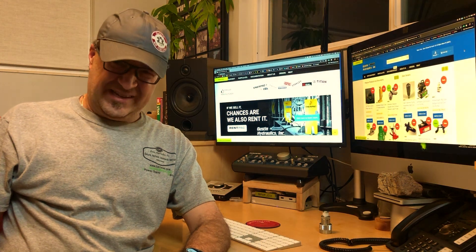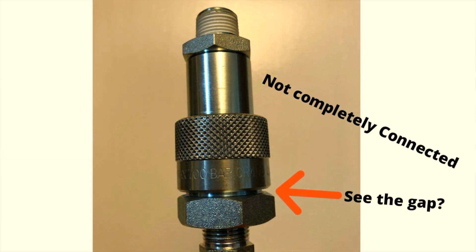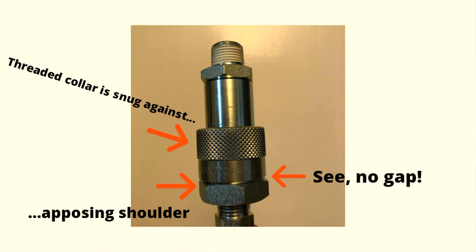Number 3: Make sure they're connected — completely connected — and double check, triple check. I'm talking mainly about threaded couplers here. This is probably the number one phone call we get regarding coupler failures. The user reports something like: my pump is pressuring up but my RAM isn't advancing, or my RAM won't return when I open the release valve and there is still pressure in the hose, or my RAM will advance but not return. These scenarios are most often the result of a threaded coupler that is blocked by having come unthreaded.